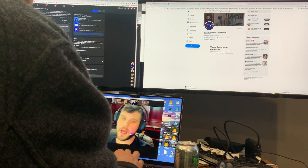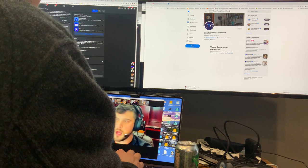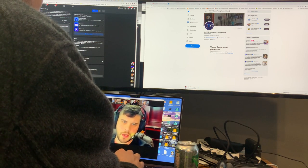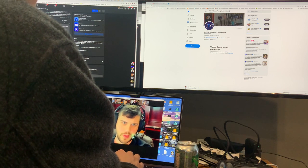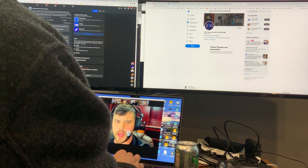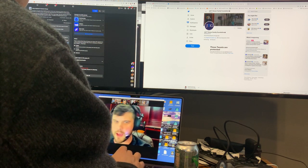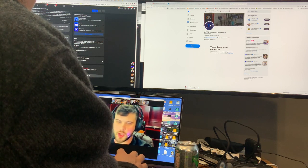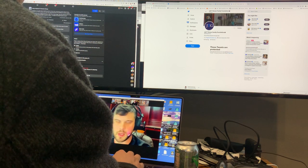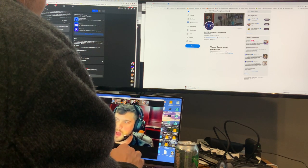But the Airpeak Flight app is the application that's used, similar to DJI Go 4. Yeah. It's a very clean layout. You have a lot of customization options for your buttons on your radio. There is no paid upgrade with that. It is what it is. You're able to view your main camera, the FPV camera, change aperture, shutter, exposure, ISO, all those things via the app. You can change the focus settings as well.